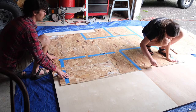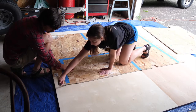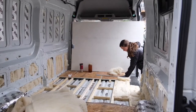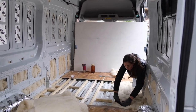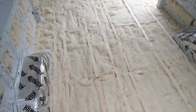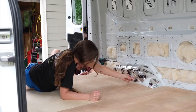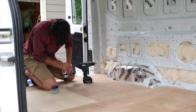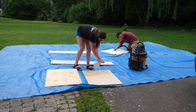While the glue dried, we used our builder's paper template to cut our three-quarter inch plywood for the subfloor surface. We laid the plywood end to end, then traced the template on top to replicate the shape. Before securing our plywood sheets to the furring strips, we insulated our floor by filling the gaps between the furring strips with Havelock wool — super easy and entertaining. We then screwed the plywood to the furring strips with wood screws, though in hindsight we would have used Liquid Nail again. Just to be safe, we sprayed all of our subflooring with Concrobium for mold prevention.